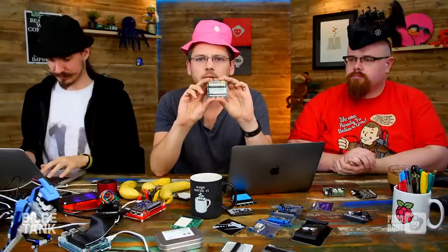So in July last year, when the Raspberry Pi Foundation released the B+ and A+, they introduced a new specification for add-on boards called HATS, which stands for Hardware Attached on Top. Boards that meet that specification basically have to be a specific size and shape. They need to have a memory chip, which lets the Raspberry Pi identify the board and set it up properly. Beyond that, they're pretty much whatever you can fit in the space.